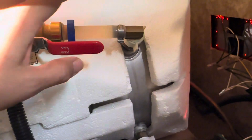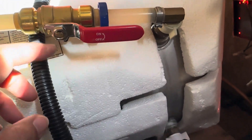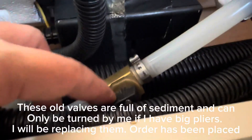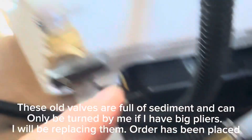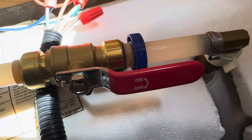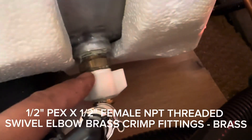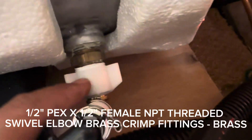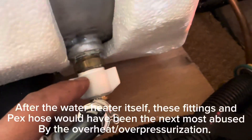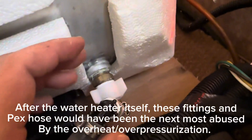So this is my hot water out, and I did not have a valve here. I have the old-style valves and I did not have this valve. So I got this SharkBite valve and installed it. This is the old thingy, and I had to install a new one because I finally figured out that it was this old thingy that was leaking.